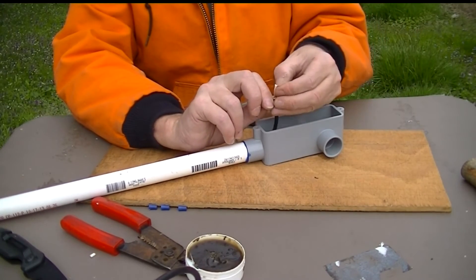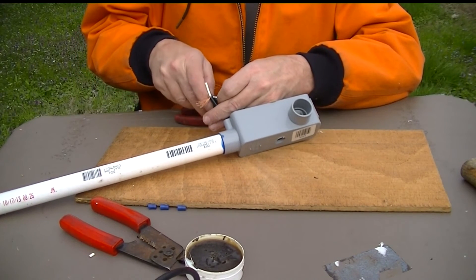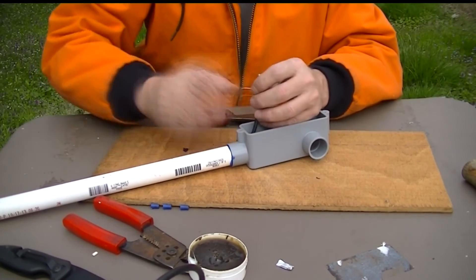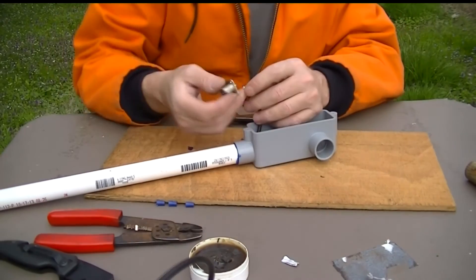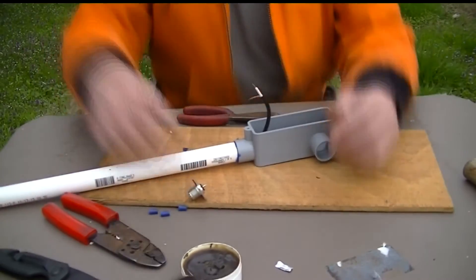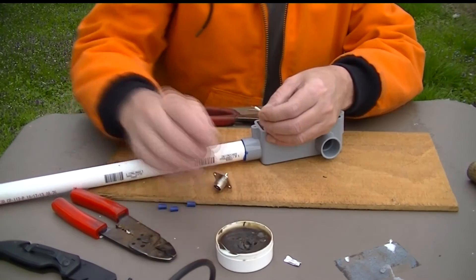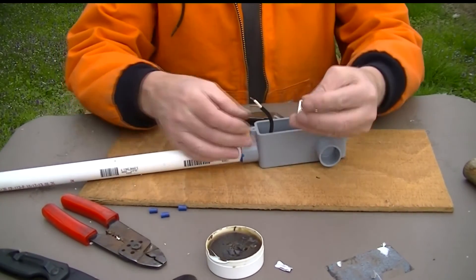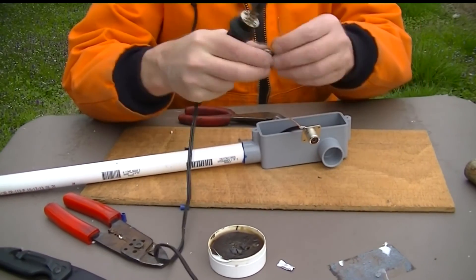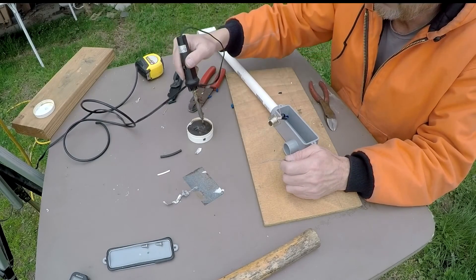Get the aluminum out of the way. Now we've done a shorter piece here because we don't have to go very far — we're just going into the SO-239, so don't nick the insulation. A little bit of flux. The center conductor doesn't get a ring — it gets the SO-239.